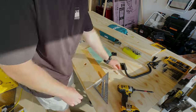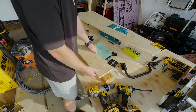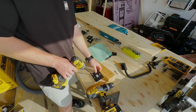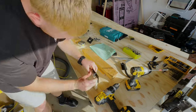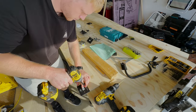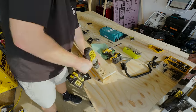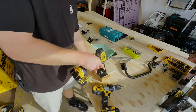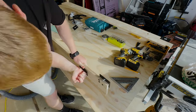Back at the head end of the side rail, install the lower stud plate — essentially where the hydraulic hooks to the bed to pull it back up. Cut a piece of 5/16 scrap to get your spacing right between the ball and the top of the side rail, leave a quarter-inch overhang on the end, and use a framing square to keep the plate square. Put three machine screws and two regular screws in that plate. Make sure you're drilling on scrap so you don't blow out the wood. Then mount the female pivot into the side rails using the number 12 silver screws — a bit more heavy-duty than the number 8s.